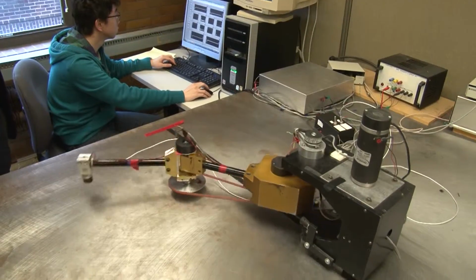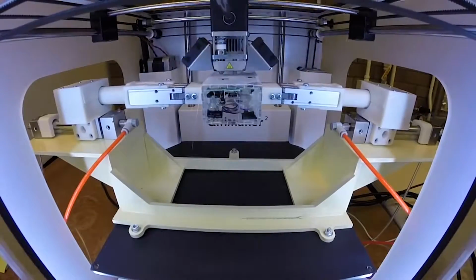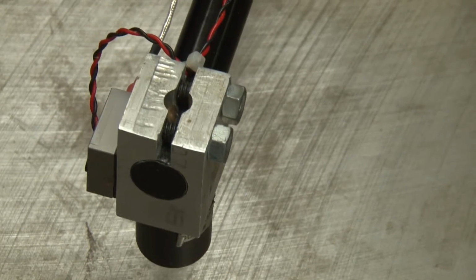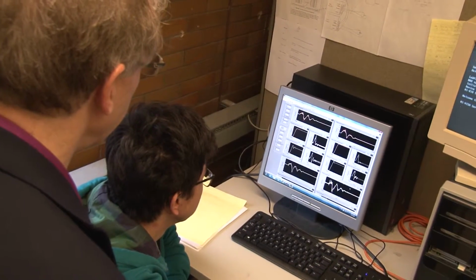Many modern robots now, if you try to move from one point to another quickly, you'll end up with vibration at the end point, which means if you want to do anything precise at the end, you'll have to wait for that vibration to stop. For every robot, it's essential for the motion. So how to plan a motion with less vibration is critical for every move. So we are dealing with finding a sweet spot such that it's quick enough, but it still has less vibration.